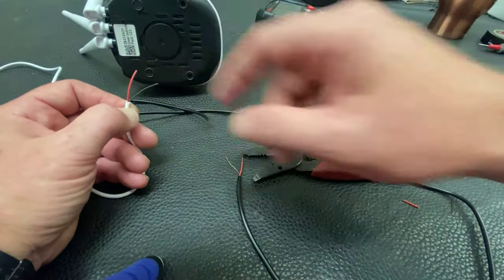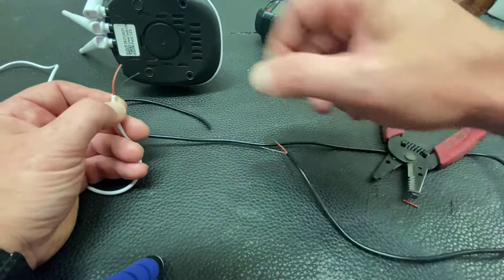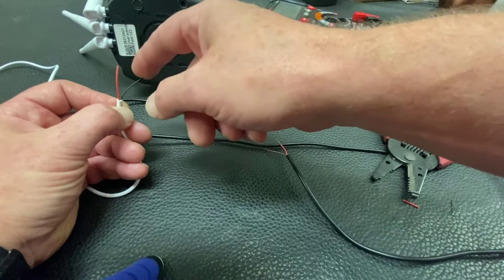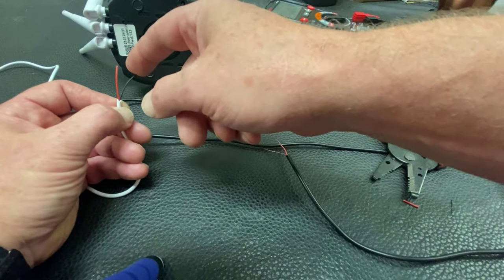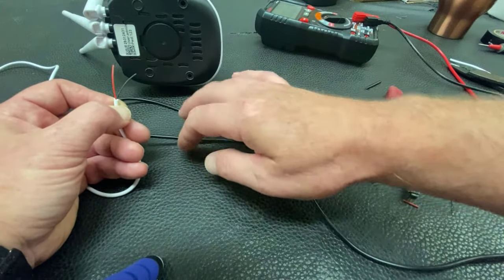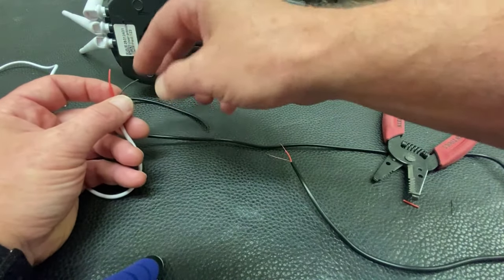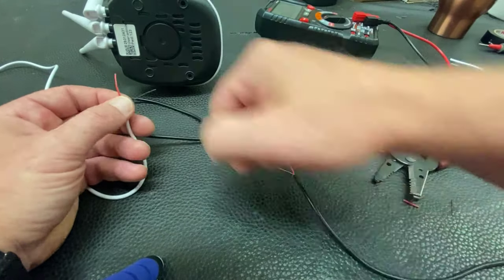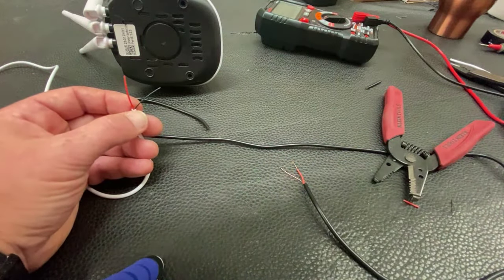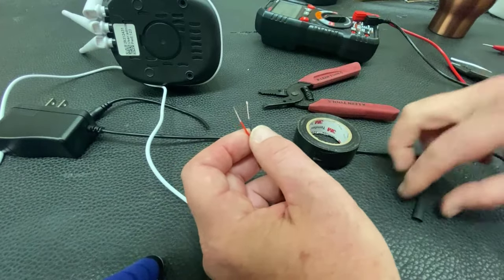Here's why I'm saying we got lucky — you can see red and black over here, red and black. In this scenario, I know this is color to color. But if you have four wires, which is what a typical USB would have — five volts DC, five volts negative, and then white and green or white and blue — those are the RX and TX wires, meaning receive and transmit, because USB is a data communicating cable. If you have those two extra wires, just omit them. Go red to red, black to black. The other two wires, just insulate and cut them off. For making new connections, most people are just going to use electrical tape, which is fine.